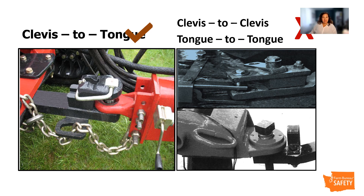The clevis-to-tongue connection provides the safest and most stable loading of the drawbar pin while allowing the required vertical angular and rotational capabilities. New tractors are generally equipped with a clevis on the drawbar. Clevis-to-clevis connections are unsafe as they can limit angular movement and put extremely high loads on the pin and other components, which can lead to mechanical failure. To remedy this, convert one of the clevises to a tongue for a safe connection. Additionally, tongue-to-tongue connections are also unsafe as they can easily result in accidental detachment of the implement. The tendency for a quick fix such as a bolt or pin is an unsafe practice, even if a retainer is used. It is recommended that the tractor have a clevis installed to achieve a safe connection.